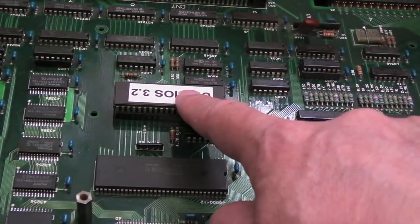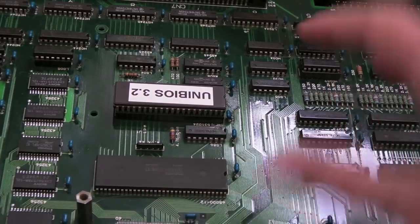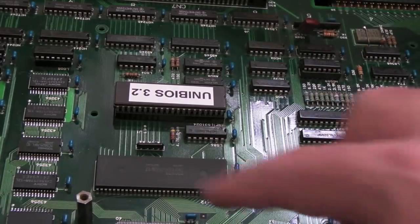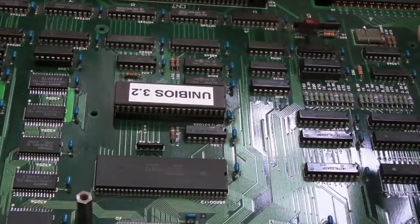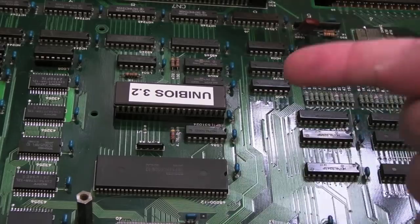With version 4, I might do another video on it when I come to work out what's wrong with it. And it's just the same on my other 4 slot. You saw we just got a black screen. You can get past that if you put the cartboard on there and put a game in slot 1, then it will spring to life. But as soon as you power cycle it, because you've not got a battery on here, as soon as it's been powered off for a few minutes and you switch it back on, if you've not got a card again, it just boot loops.